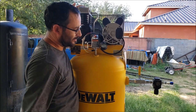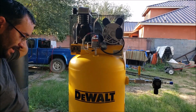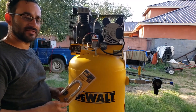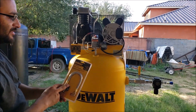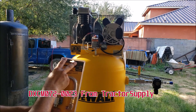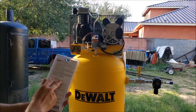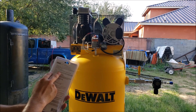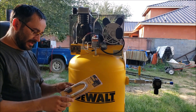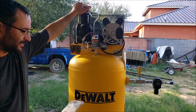There's a 3/4 inch outlet here that I reduced down to half inch — haven't had any issues so far. Since I'm going to be mounting it in my shed, I needed a way to access the tank drain, so I bought this extended tank drain kit. It's a DeWalt kit, part number DXCM072-0023 — a flexible hose with quarter inch MPT threads, 175 psi maximum working pressure, and pre-applied thread sealant.